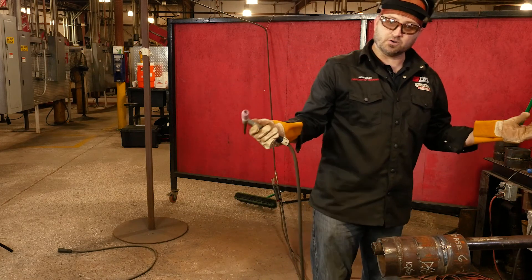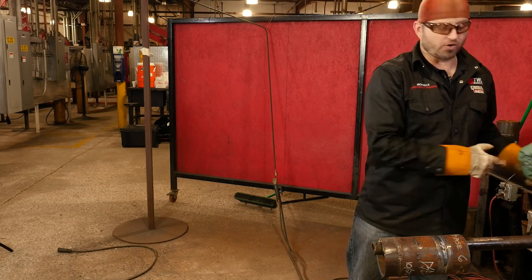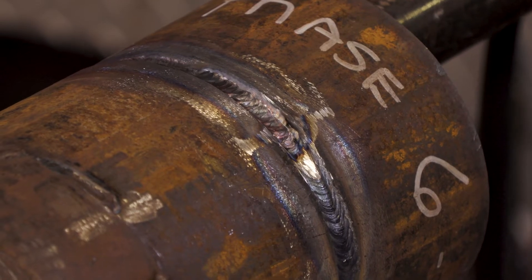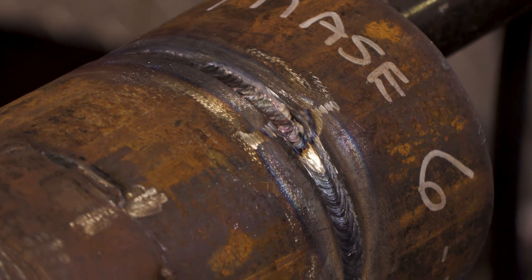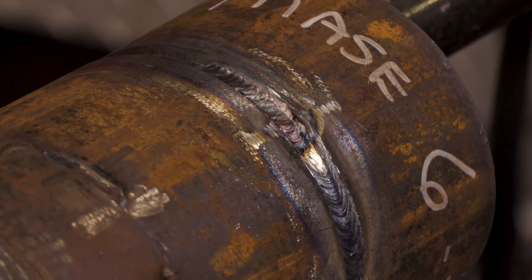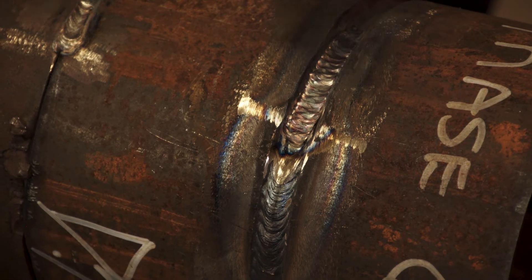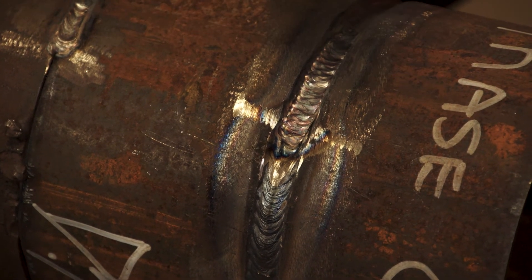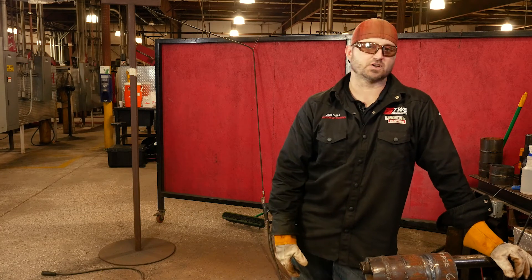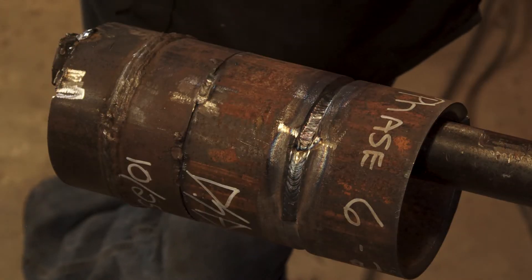And that is how you close up a hole and repair a weld. The same thing would apply if you popped a hole or had a bad spot on your root — say you went and shot x-ray and had a bad spot there. Same thing applies: you find the area where the defect is, grind it down to where you get the defect out. Try not to make a big mess out of it. Pay attention with your grinding, because a lot of people think you can just go in there, make a mess of things, and then it's twice as hard to fix it. So take your time, watch what you're doing, pay attention. It's easy to grind it all down, clean it up, and then it's very easy to repair. But if you just get crazy and start grinding away, you're going to make a mess, make big holes, and then you're going to struggle to repair your weld.